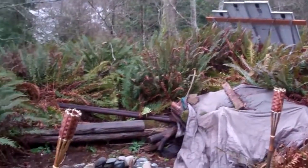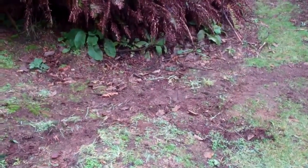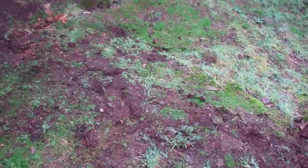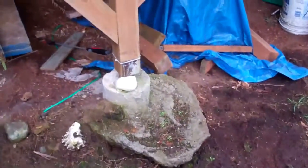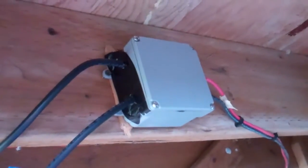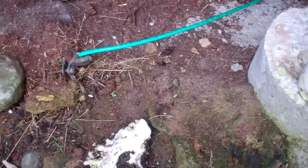We're back outside and I made a bit of a mess in the yard — I buried the solar cable. I highly recommend buying the real stuff; it's UL approved for moisture and ultraviolet light. That goes up into a combiner box, which I saw somebody else on a YouTube video show how to do. And down here is the ground from the batteries — I've got a copper rod going into there.